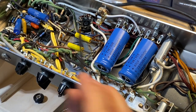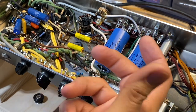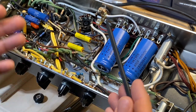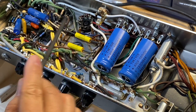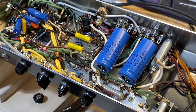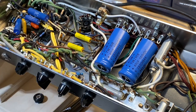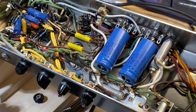Anything that's non-conductive, do not use a screwdriver. I don't care if you say, oh, I'm holding it by the handle, it's plastic. No, nothing metallic. Because even if it doesn't shock you, if you're moving something around and it slips and it's metallic, you can end up welding that thing in there because you've done a short circuit across, you know, 400 volts. Just don't do it. Okay, so anyway, lecture over.